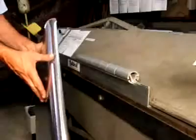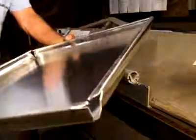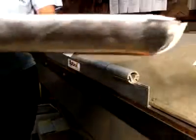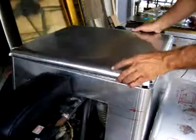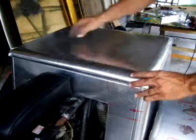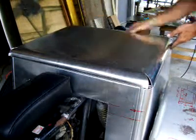One's ready to be dollied. After forming our lid, we're going to bring it in here and set it on our box and check it out for size to see how the edges line up. Tuck them in or out as needed before you start your tacking. Before dollying the radius corners, tack the bottom flanges first.